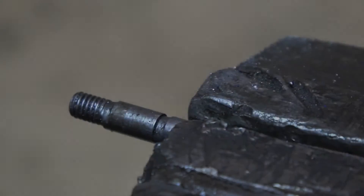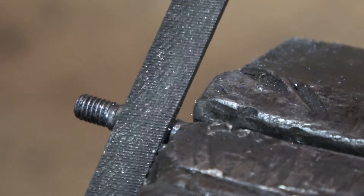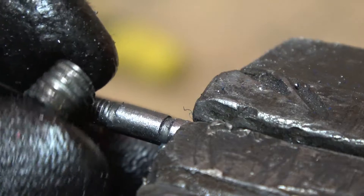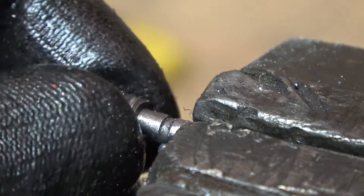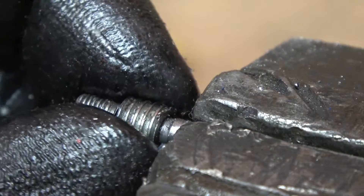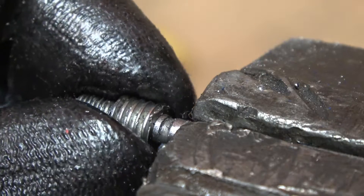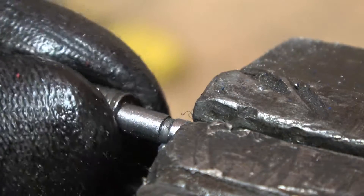The pin itself can end up with little burrs on it, so you can just clean it up a little bit. When you've done it right and cut it to the right length, file it and get all the burrs off - it should be a nice fit on there with no wobble. When we put this together we weld this in as a spacer, and it's going to be running on all that fresh material.